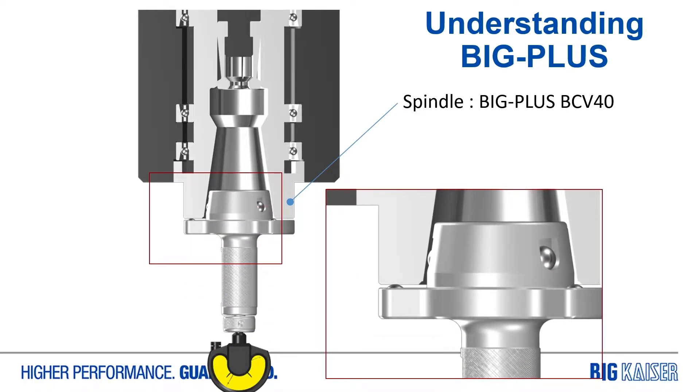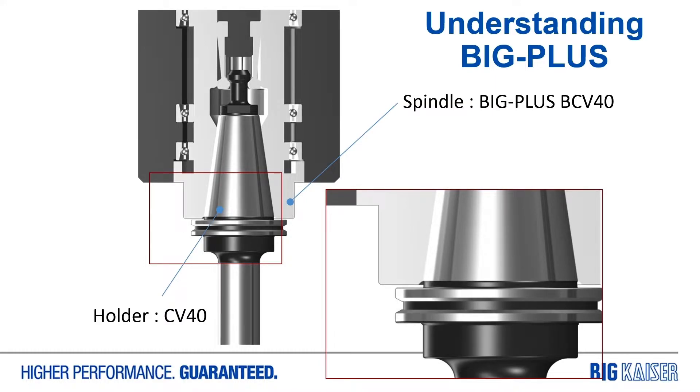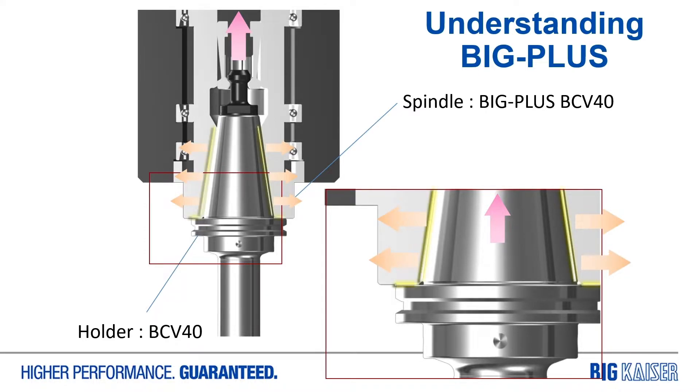Big then produced gauges so that these builders could use a simple gauge to confirm the position of that face relative to the gauge line. They made it in such a way that only some of the material goes on the spindle and the rest goes on the tool holder. So if you have a standard CAT 40 tool and you put it into a Big Plus CAT 40 spindle, the only change you'll see is that the gap becomes smaller, in this case down to 85 thou. But if you put a Big Plus tool holder into a Big Plus spindle, you'll first make taper contact only. It was designed so that as the retention system is activated, the spindle taper will expand, allowing that tool to draw into the spindle until it makes face contact, giving you full taper contact and face contact simultaneously.